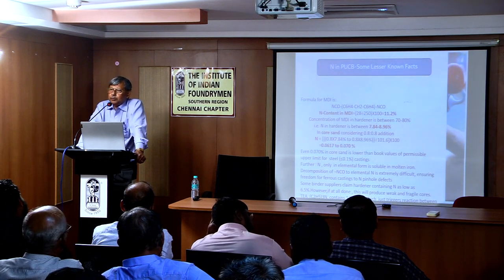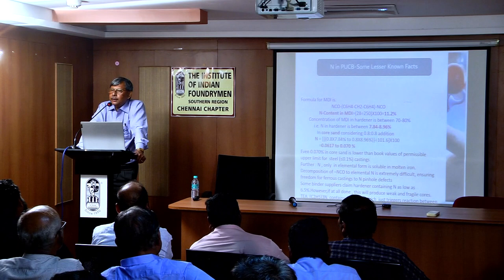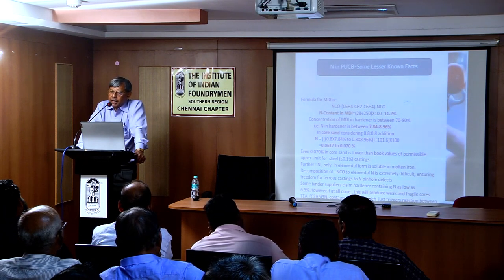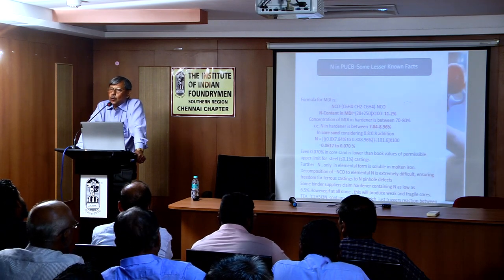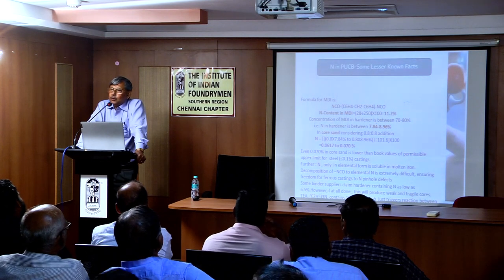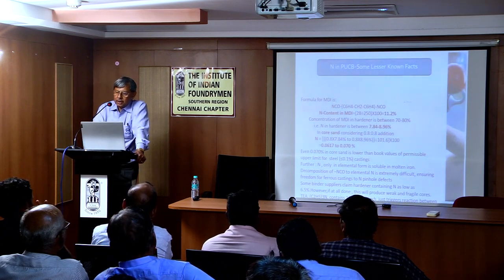Then another safety parameter is that even in steel casting, the core nitrogen specified is less than 0.1 to be prone to defect for nitrogen defects. Here it is not more than 0.07% even taking into all considerations. So friends, yes, it contains nitrogen, but nobody can tell you that other materials contain less nitrogen and that I am facing nitrogen pinhole problem because of your hardener.